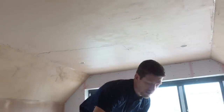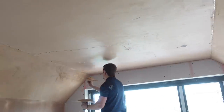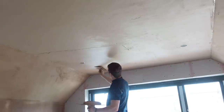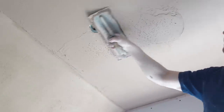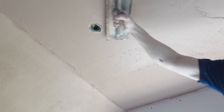Just whacking the second coat on — nothing too hard, nothing much to talk about really other than how these angles finish once the ceiling's done. The second coat doesn't need to be as thick as the first, but with instances where we're working with built-in downlights like this, you want two solid thick coats to make sure you're completely covering the whole area. I've been second coated now — just got to do a clean up and then I'm going to start flattening. So far, so good — spotlights covered well and the stop beads are looking okay.